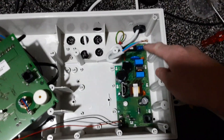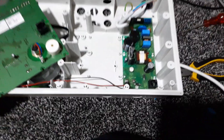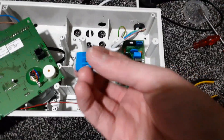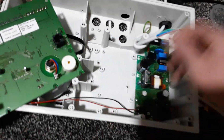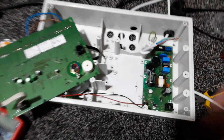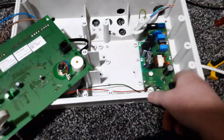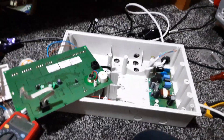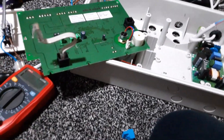Make sure there are no fine wires touching each other, no tiny little wires sticking out of the terminal block, because they can touch each other and go bang. Check your fuses, then once you've done all that plug it back in and put it back together as you found it. You have to unplug it and turn it off before touching any of this board — it is mains voltage. If that red light is on, do not touch it. I hope you find this video useful — comment and subscribe, thanks.